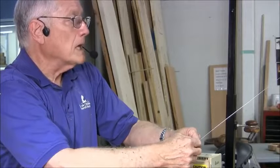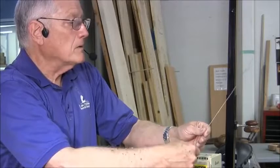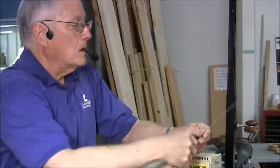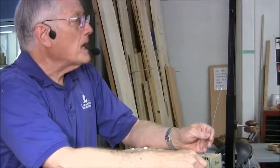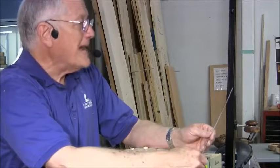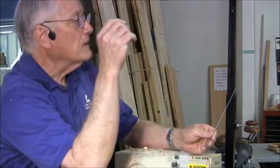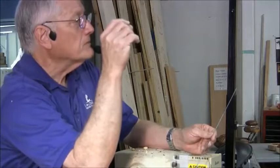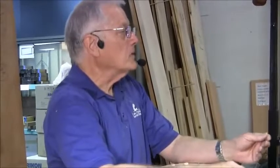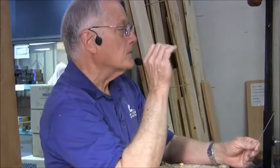So they had to make a plan. It may not have been a detailed plan, but they knew where they were going. The way they would do that is, if it was going to be a 50-foot boat, they would have 50-foot battens. A batten was a piece of wood, might be a half of an inch thick, might be 3/8 of an inch thick, very finely planed. And it was something that was cherished. It was a key asset of the boat building operation.